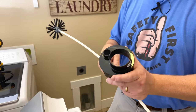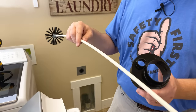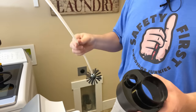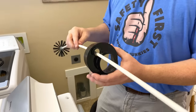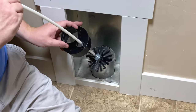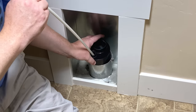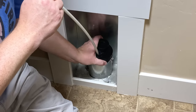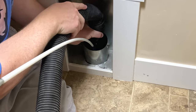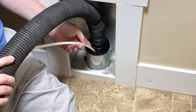This also comes with a little vacuum adapter that has two holes in it — one is where you attach a shop vac and the other is the hole that the rods go through. One important thing to keep in mind: you can't put this on the duct first because then the rod isn't going to fit through it. Instead, feed the rod through from the back side first, then you can put this onto the duct and attach your shop vac and start cleaning. Fish your brush a little ways into the duct, then the adapter can fit right on top and down into the duct. Grab your shop vac and put its hose right into the duct adapter. With this setup we are now ready to start cleaning the ducts.